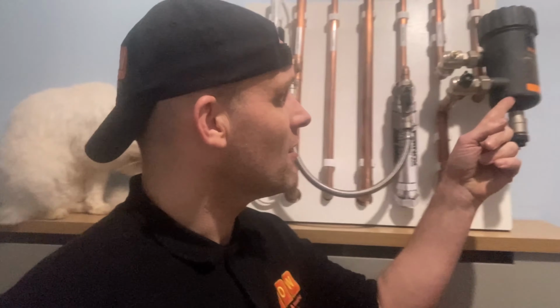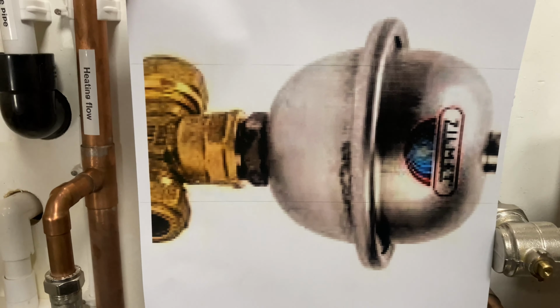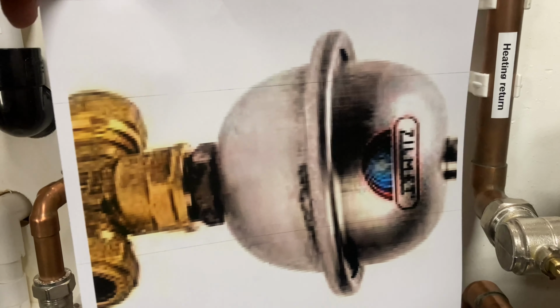Wow. So magnetic filter, descaler. The further south you are, the more protection you need against scale. You might be better off with a zeolite, like a base exchange unit. So the water will go through it, the salts will break down the water molecules. They'll protect your showers, your taps, your shower heads, and the water will taste better as well. And also, a real water softener can be beneficial to your skin as well. If your combi has loads of plastic components inside, you can also fit a mini shock arrester. That'll absorb expansion and protect inside the boiler.